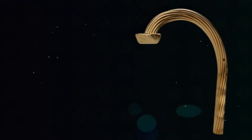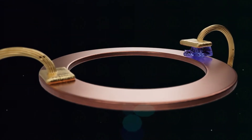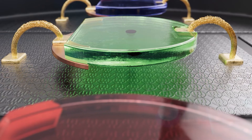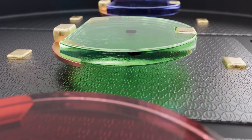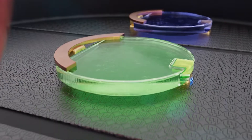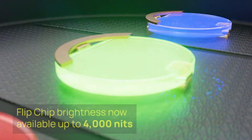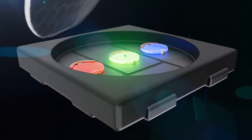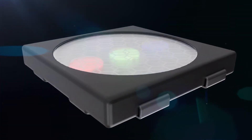Next is flip chip. SMDs are soldered to the circuit board using microscopic wires. Electricity in LED displays is expressed through either heat or light. The electricity carried through these wires creates heat and reduces the amount that can be used for light. Flip chip displays literally flip the SMD diode over and get soldered directly to the circuit board, eliminating the bonding wires. Flip chip displays are brighter, reaching up to 2,500 nits, and well-engineered displays are also cool to the touch, making HVAC considerations a thing of the past.